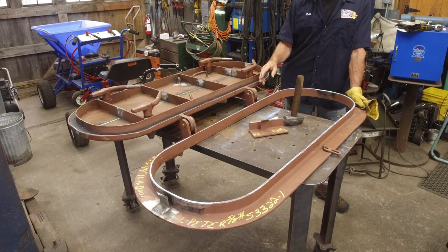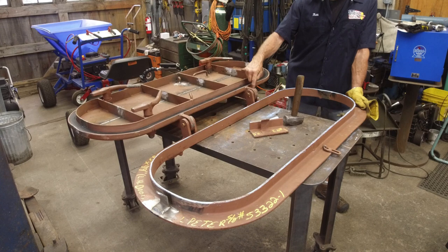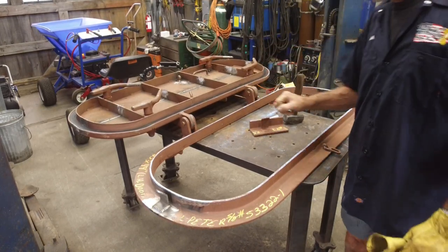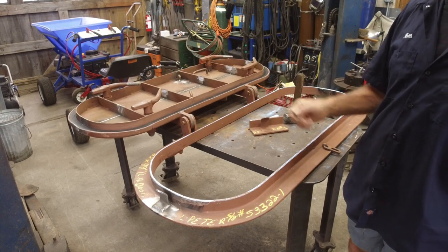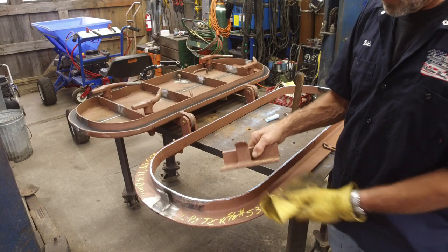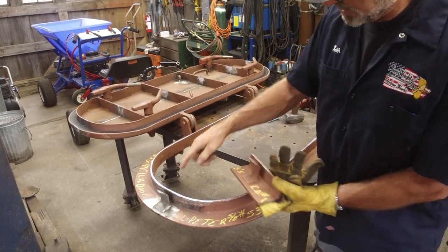We're ready for our final fitting and check. We put the Delrin washers in between the hinges, and we put the pins in with the cotter pins just slightly sitting in there, just slightly tweaked so they won't fall out. The very last thing we did was create this piece on the plasma cam. It's just a little foot.